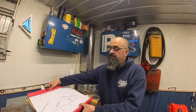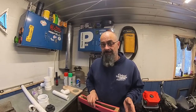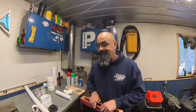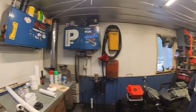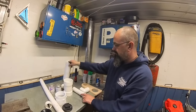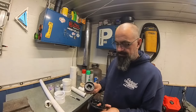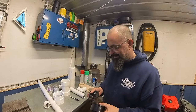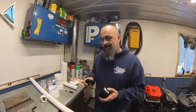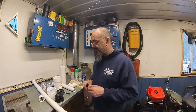So here's what we're starting with, a couple of precautions. I'm not a professional. I do a lot of dumb things. I don't suggest that you do what I do. It might end up badly. But I will give you some precautions here. So the first thing, there's these pieces all out here. This is PVC. The black pieces, though, you wonder, what the heck's up with that? Well, these are what's called DWV PVC. It's not meant for pressure. This is a pressurized vessel when it fires.